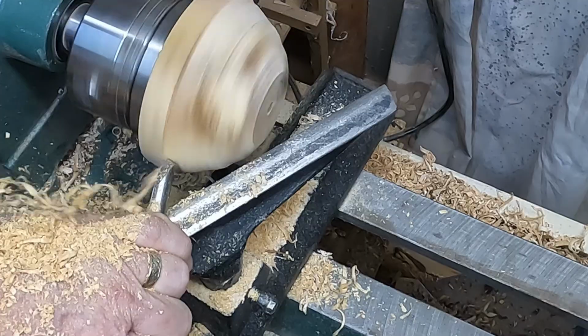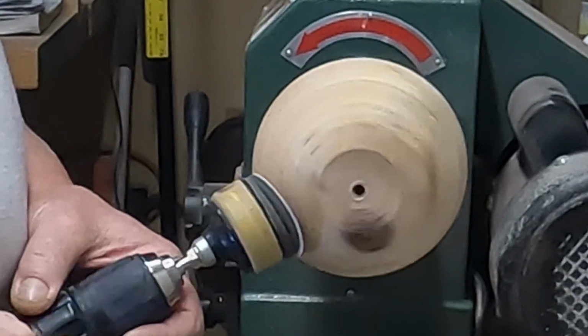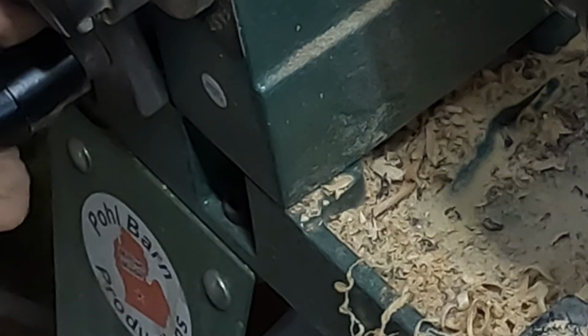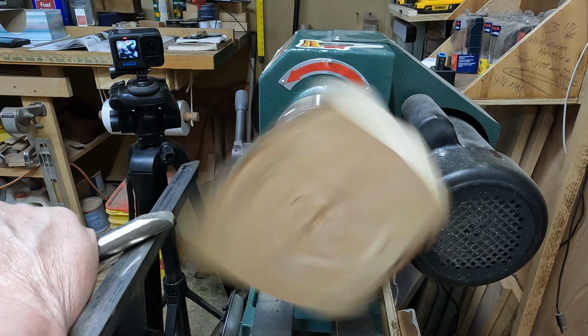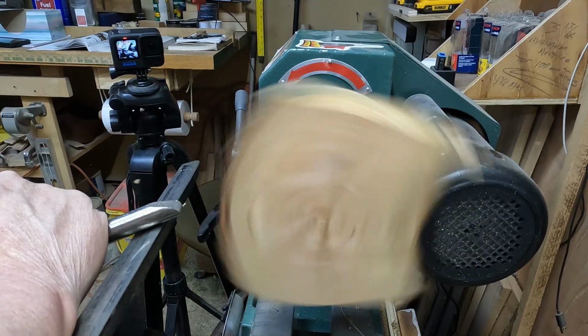However, I wanted to finish the first one, so I spent some time sanding it. When the Forstner bit was introduced into the equation, I noticed that the hole in the base was larger than the Forstner bit. This meant that the head of the lathe was not in direct alignment with the tailstock. No doubt this happened when a tool dug in too much or there was some other impact, which indicates it wasn't tightened as much as it should have been. I made a change in the alignment and was happy with it.